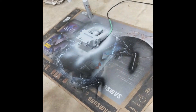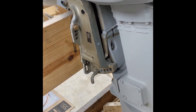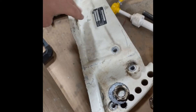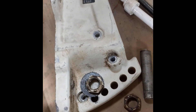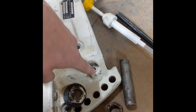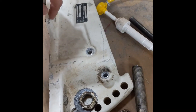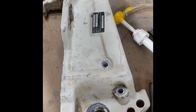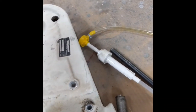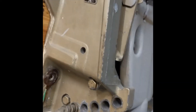You just need that unit and all the rest of the mounting hardware that comes with your engine will work just fine in order to install it. I had bought mine and it came with the arms off of the 235, but I found out it's pretty much all the same bolting. You got a pin that goes through your center tilt - that was kind of hard to get out. Then you got a couple of bolts that hold the motor and the trim cylinders in, and they go through each side. They got all the same holes on the manual tilt.